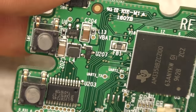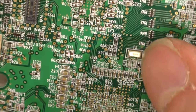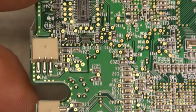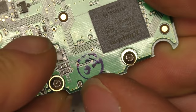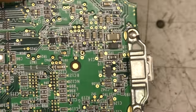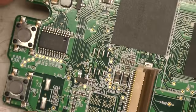There's a 74LVC245 buffer — probably for IO related to the buttons. There's also an LPC812, a very low-end Cortex-M0 processor, probably handling on/off power management and controlling the LED dimming. A pad labelled 'FL_BUT' is presumably flashlight button. There are quite a few labelled test points. A TPS65217 provides the power rails for the processor and memory. UART TX and RX pins are marked — possibly for the Bluetooth interface. The micro USB is very ruggedly attached, soldered into the PCB and reinforced by a metal frame.